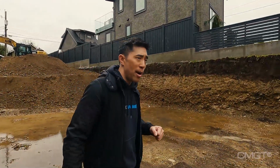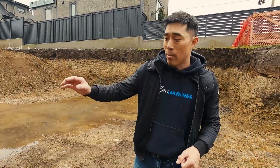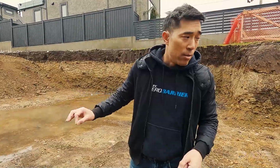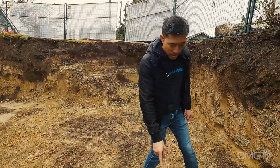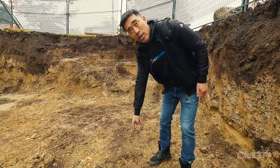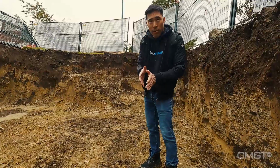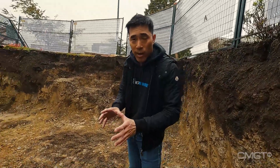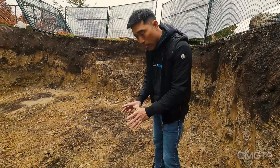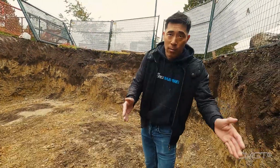The engineer will stop by. He'll approve that it's been done properly. And then, following that, the surveyors will be coming in to pin on their corners. Now, the pinning of the corners of the walls takes place at this level where you shoot in a nail into the ground, and that's where the corner of the building sits. And that's where the framer will begin his form work, right over top of that pin, to ensure that there's no encroaching over the property line.